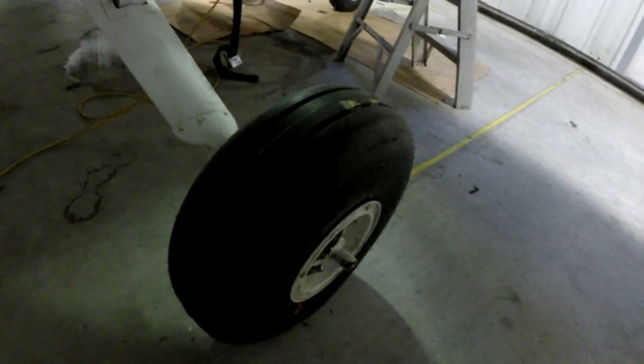While I'm at it, I'm inspecting the aircraft and doing an annual inspection. Part of the other problems with the airplane were tires — I've already put three new tires on the airplane. Also, you see this little lever here that goes down — that's a fuel selector valve. When I got here and put gas in the airplane, the fuel was leaking out of the selector valve, so I had to disassemble that and replace it along with a bunch of old O-rings.